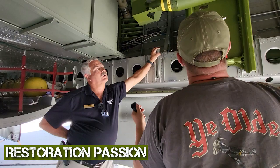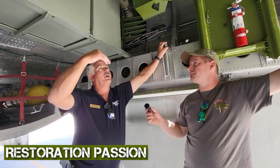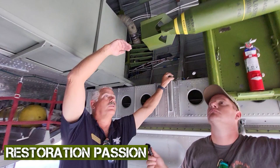And then, if we can go to nuclear first, quickly talk about, they had to modify the plane to take the two nukes. Do you know how much? The biggest modification in the bomb bay was they took 8 inches out of the bottom of the tunnel. They just squared it off. It was still sealed. And then the shackle mounted there, because both the nuclear bombs were single point shackles.